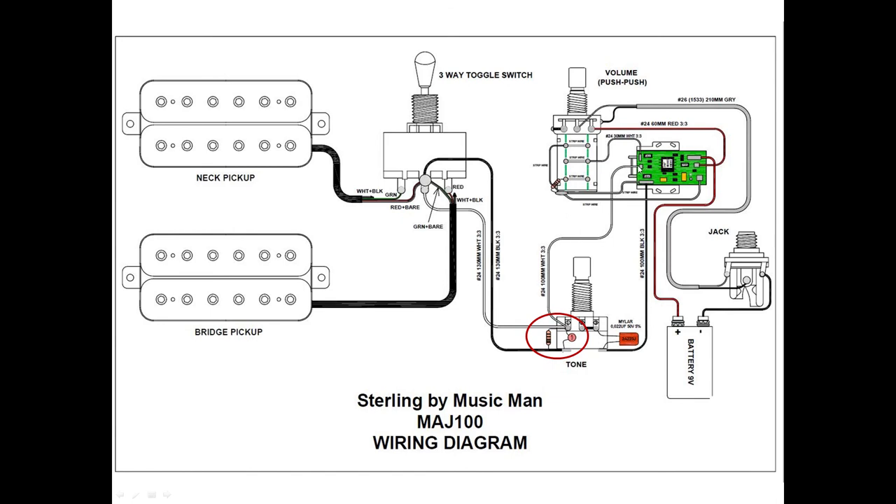So we get out of the tone, then we'd normally hit the volume, but actually we hit the boost circuit first. This means this is the input of the boost circuit — in the general case we'd jump straight to the volume. From here it goes into the circuit, gets a boost, then goes up to the volume, and then from that point to the output jack.